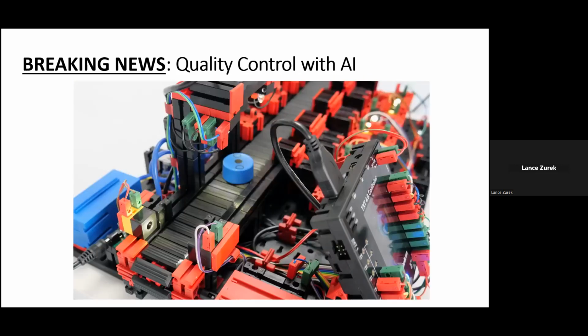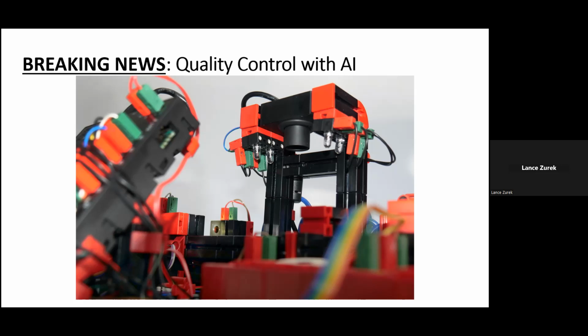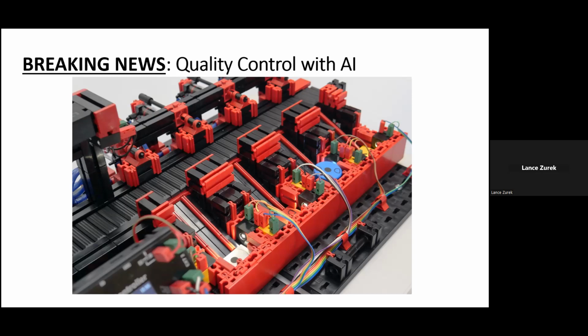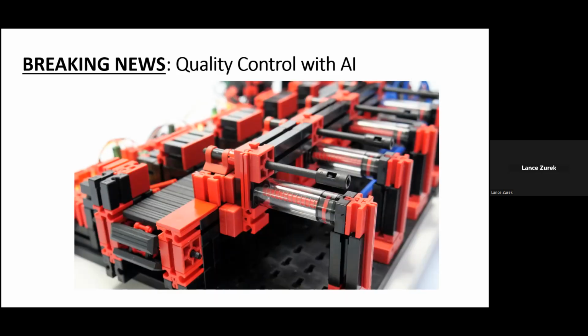The workpieces get scanned by the camera, and they are classified with the aid of the trained AI. Now, depending on the color feature and the fault pattern, the workpieces are then sorted by the artificial intelligence on the basis of their quality features. The AI used is realized with machine learning in TensorFlow, where an artificial neuronal network was trained with image data.